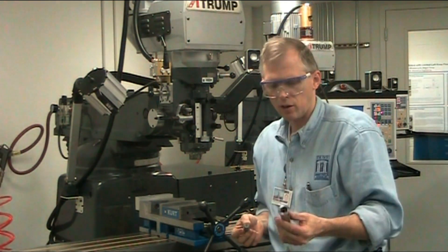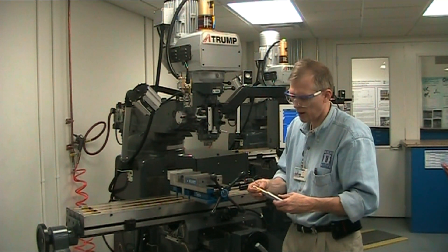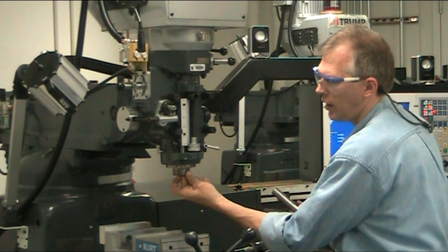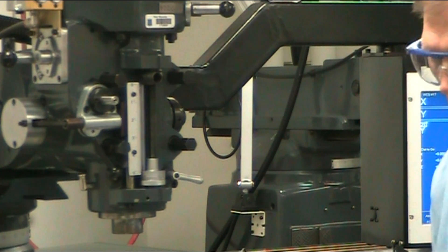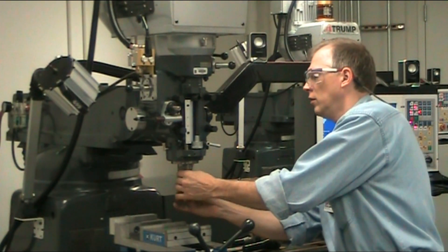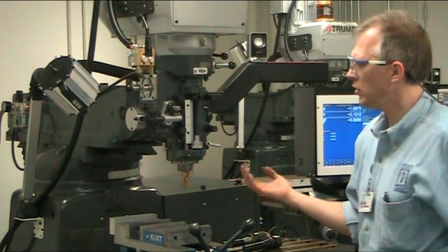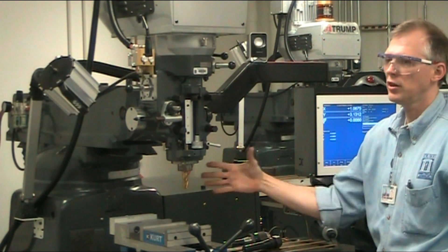With your R8 tooling and this collet system, you find your end mill and the collet that you want to use — that same size — and you install your end mill into your collet system. You come over and check to make sure the key and everything in here is clear inside the spindle, and make sure your keyway on your R8 collet is clean. You put your R8 collet into your spindle, hold the brake, press the in button, hold it about three seconds, and it installs your end mill and your collet in the spindle.